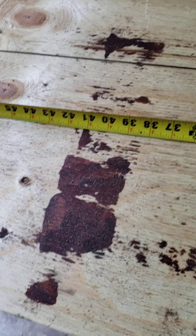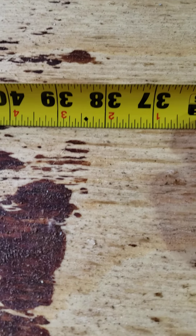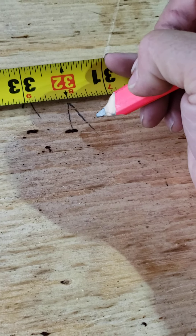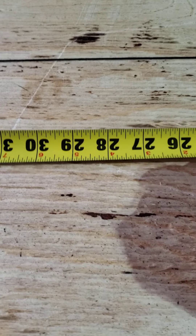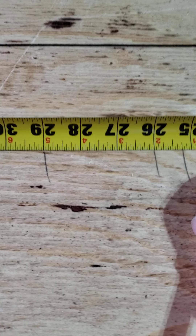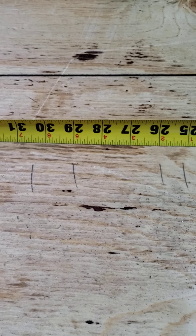Now if you're taking drywall numbers for cutting out pieces — for topping out, things like that, or even plywood — you're going to be getting numbers pretty quick. One thing I've been experimenting with is making a tick mark where I start up here, go a very small distance and come back up. I still have a tick mark but I'm not doing multiple moves. Typically when I do drywall numbers, I'll begin a number: 25 and a quarter, 26, 29, 30 and three-eighths. I just make those tick marks because I know on my drywall sheet which side it is, where it starts, and then there's a trailing side. That's a quick way to take a lot of numbers very quickly.